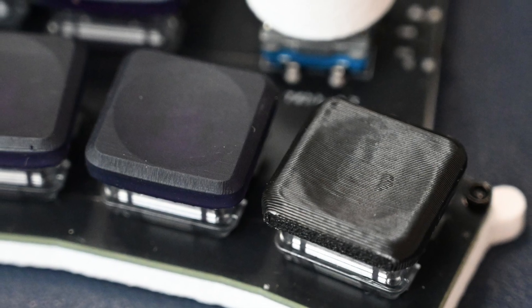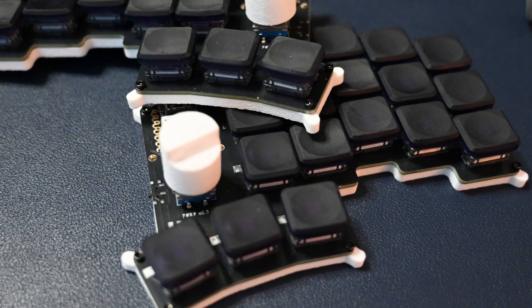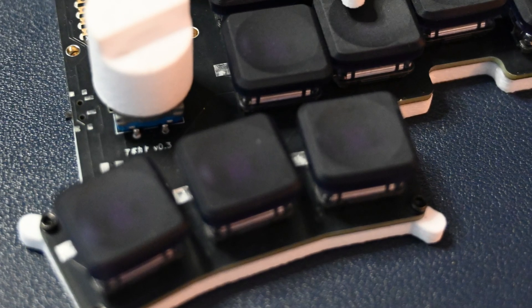The quality comparison is quite big. If you print with a filament printer in PLA or PETG, it looks definitely way worse than the ones from 3D Keycaps, because they print with SLA and they feel really good. What I really enjoy is that they are slightly shine-through, so you see a bit of the purple key switches, and the typing on the purple switches is amazing.